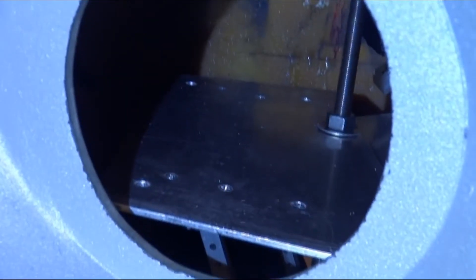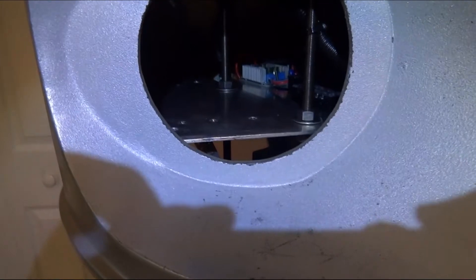You'll see this is the arm hole, and that's the shelf that the arm was bolted into. You can see the holes right there — here and here — and back there are those aft holes, two of them. What we're going to do next is loosen up these two nuts right here — this one and that one. That will let loose of this shelf. There are also some struts down below that we have to take out. You can see the struts right there. There are two of them — one here and one right in front of us.